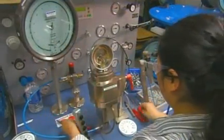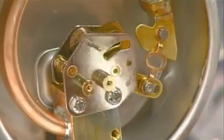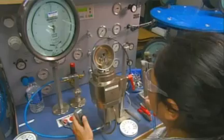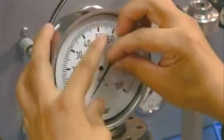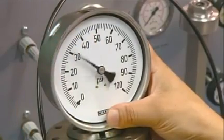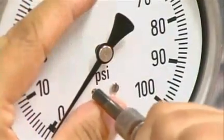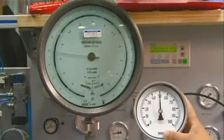Next, a worker calibrates the assembly. She loosens up the connecting link slightly to prevent friction, puts on the indicator needle, and runs a test. After a bit more adjusting, she puts the faceplate and the indicator needle back on. She ensures the gauge reads accurately at three key positions, then screws the faceplate onto the gauge. A final test confirms it is calibrated properly.